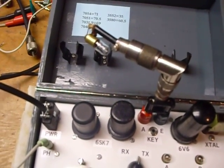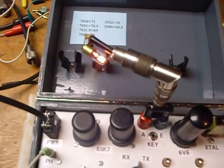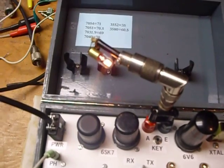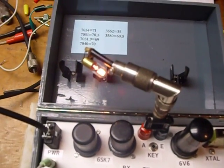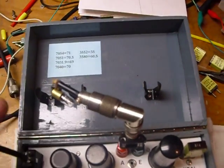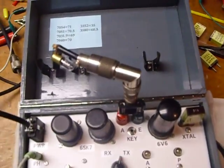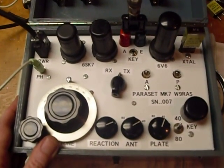That's not a number 47 bulb — that's a 313, and it takes 5 watts to light a 313 to full brilliance. We're running about 3 watts here right now. I can get 4 watts out when I tune it carefully. But that's the project here — it's coming along really nicely, and I'm just really happy with the way it's working.